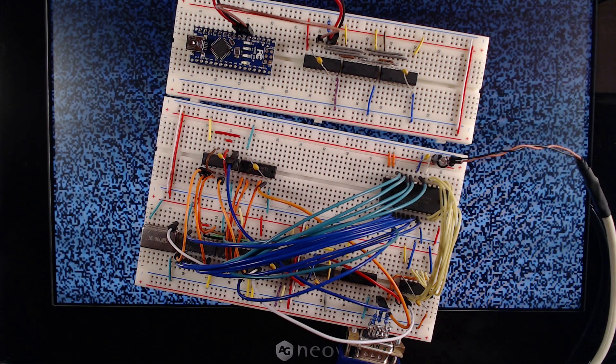The Arduino can shift 24 bits serially into these registers. That's coming from pin D2. D3 is the serial clock and at its rising edge our data bit at D2 is shifted in. And once we are done with all 24 bits, we can simultaneously update our registers' output with a rising edge of the register clock coming from pin D4.